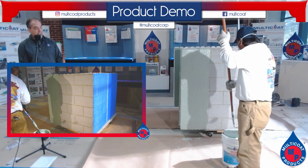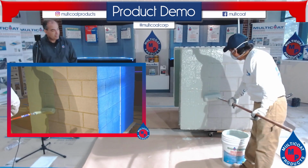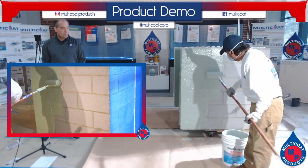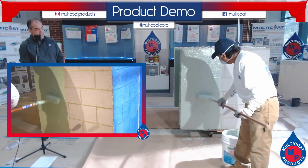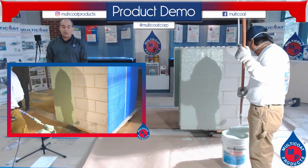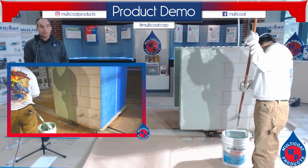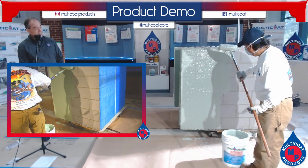If it's a warm day, the first coat typically will dry in about an hour and a half. And you're able to apply the second coat the same day. And if it stays warm through the day, you may be able to backfill at the end of the day. This product does not require any protection board. And like I said, it's less than 5 VOC.